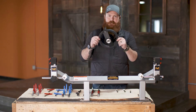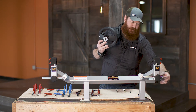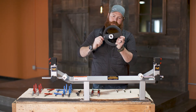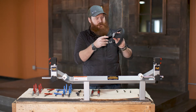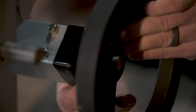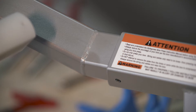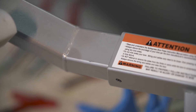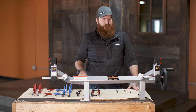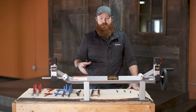The last thing you're going to want to do is drop the hand wheel on. This hand wheel goes on a pin that has two flat spots where you're going to screw your set screws down. So all you do is find the flat spots, line up the set screws, and drop this on — super simple, just like that. That acts as your hand wheel to lengthen and compress the entire system. That literally is the main setup of the Spike Press. If you can get that done, you'll have it done in five minutes and you are ready and operational to press a bow.